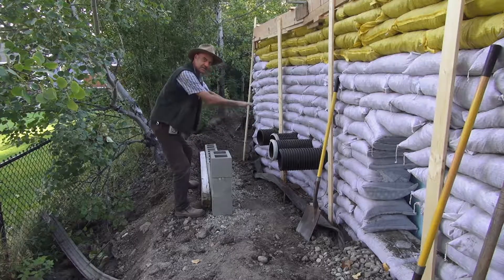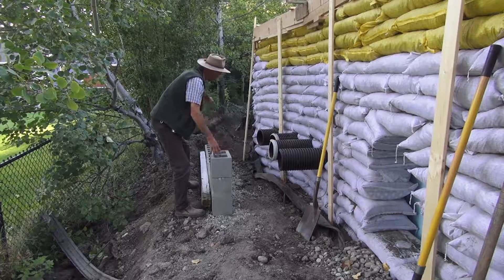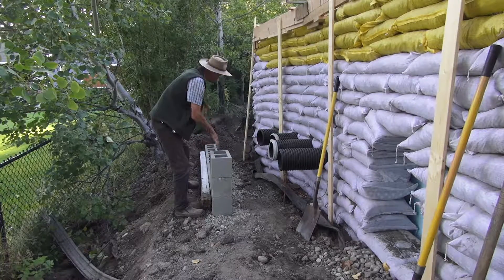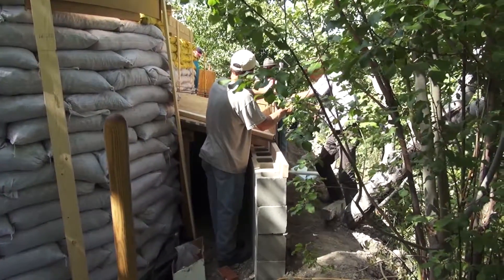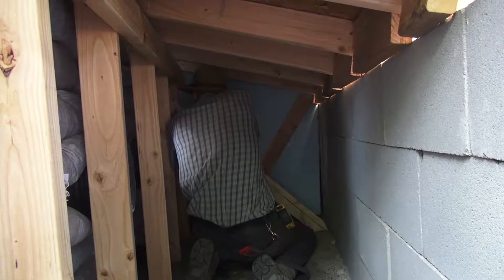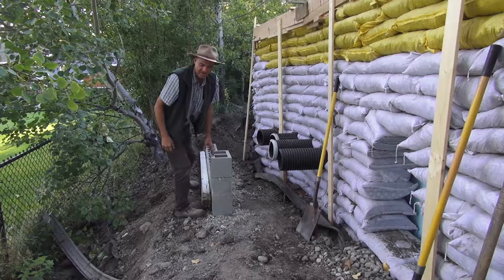In between, where these tubes are going into the north wall of the greenhouse, this part we're going to use cinder blocks, fill them with concrete, and there'll be some rebar in here, then we'll put a roof over it. This will be a green roof — it's going to be underneath the terraces — and it'll allow for a nice large volume of cool air that we'll then use to pull through and create air conditioning for the greenhouse when it gets too hot.